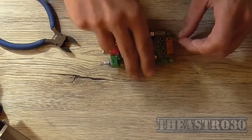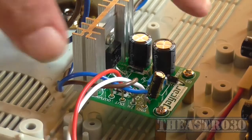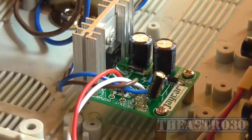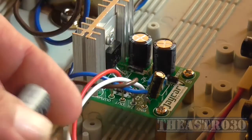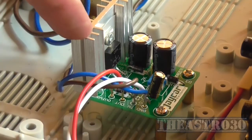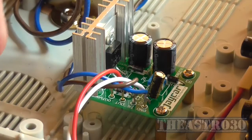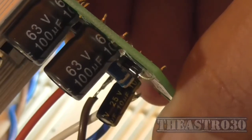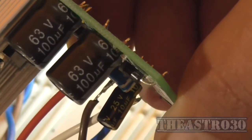The green ones are exceptionally good too. Now, before I get started, I've got the DDS open. I'm going to replace this, I think it's 470 microfarad capacitor here, which is the mains filter capacitor, with this 2200 instead, just to, A, reduce the ripple being regulated by this, or trying to be filtered by this regulator, and it probably would give me a much cleaner output on the DDS. Correction, it's only 100 microfarad. Yeah, that's way too small for a filter cap. So I'm going to change that to the 2200.